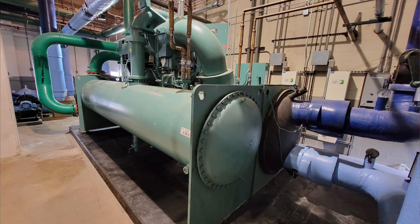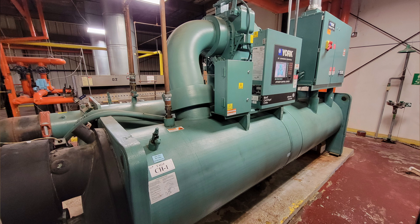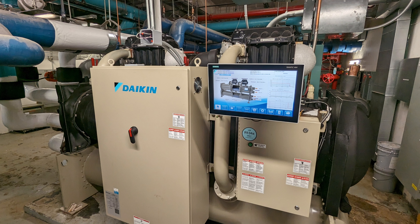Ideally, I'd really rather stay in between 20 to 30 degrees. It's a fairly tight window, but if you can manage that with a heavy load on the system, you're doing pretty well with your refrigerant management and how everything's working. As I hit that 40-degree mark and the temperature continues to scale above that, something's wrong. What's causing that superheat to rise so high?